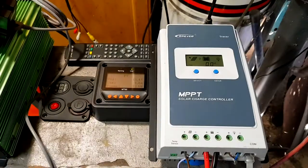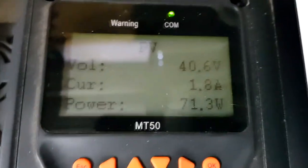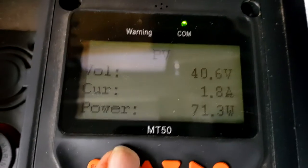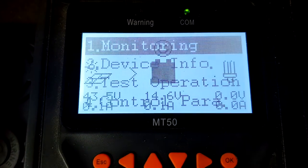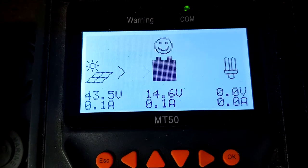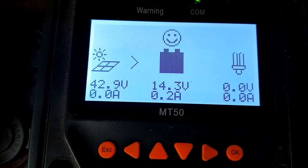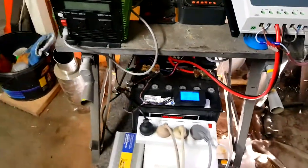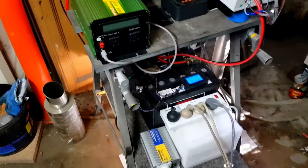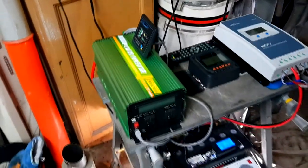I like that this system monitors pretty quickly. If I actually turn off the inverter - inverter's off, lights are off - let's see where that jumps to. It jumps down to 7 watts, which is basically just finishing off the bulk charge, just about ready to go into float charge, particularly when it's only 0.2 of an amp. The batteries are as full as they're going to get. So yeah, when it comes to the inverters and the solar, the solar compensates well. When it comes to how good is this inverter - yeah, quite good, I'm quite happy with it.